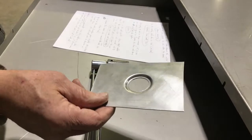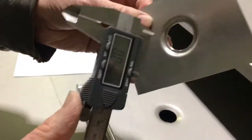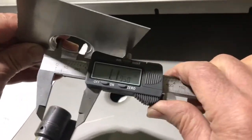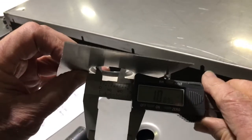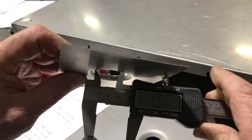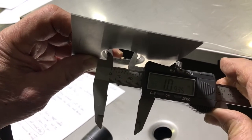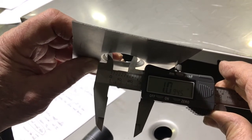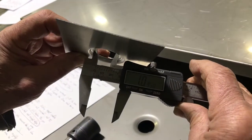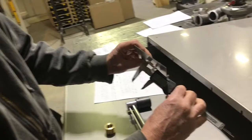If you remember, the hole was about 1 inch — about 1 inch and 16 thousandths. Now we're going to see what the hole growth is. We're approaching almost 80 to 90 thousandths more than it was originally. That's the hole growth that there's really no way to get around. But at least we're no longer having to seal against that conical shape.